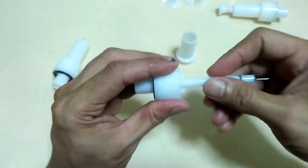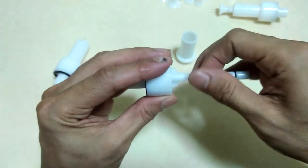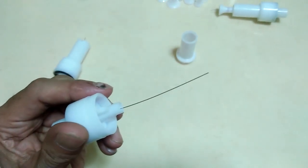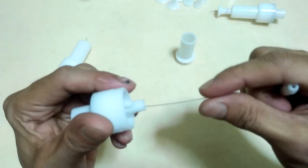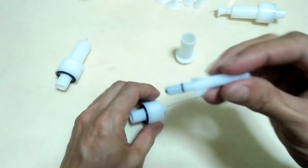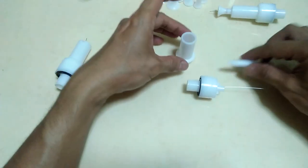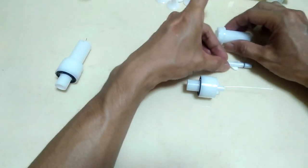Inside, there is this shaft that is threaded to the center. Removing the shaft, we will see the stainless steel electrode. It is made thin to easily produce the desired corona discharge effect that we want in powder coating. It has been a mystery to me how the center electrode on the nozzle is connected to the high voltage output. And today, I finally find out how.